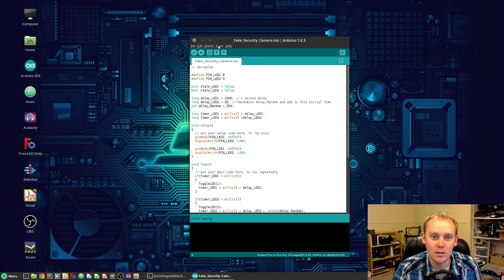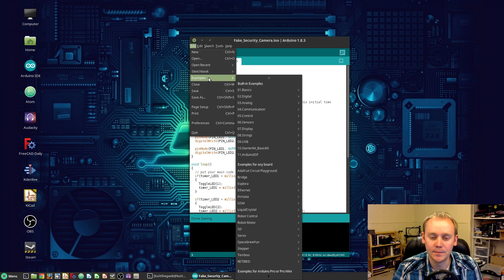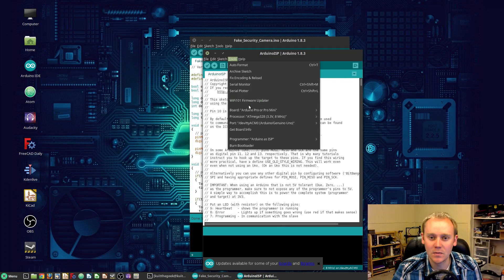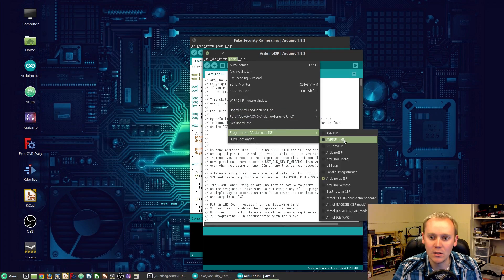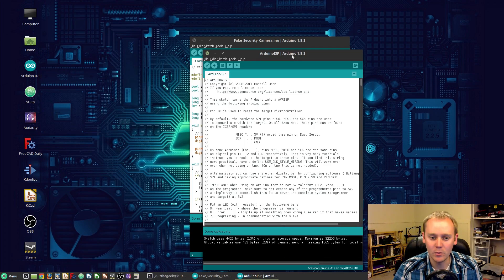The first thing we need to do is program the Arduino to use the ISP. So we're going to come down here to examples, ArduinoISP, and open this. We can open our tools, go down here, and we're going to use the Arduino Uno. We also need to make sure the port is correctly selected, which mine has automatically populated. And for the programmer, we need to use the AVR ISP MK2. Now that that's all done, we can hit upload here. This will talk out to the microcontroller — compiling the sketch — and we've uploaded. It's done uploading, so everything was done successfully.